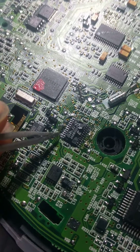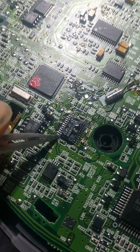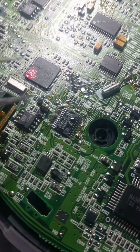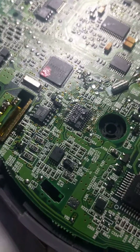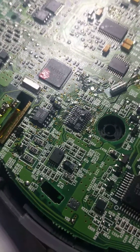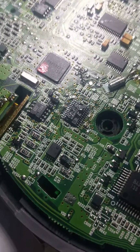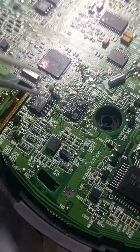A little bit of research unveiled that pins 23 and 22, I believe, so it's a 24-pin TSSOP chip. So 23 and 22, these two pins are the line outputs. And then pins 21 and 16 are headphone outputs. Interesting thing that I found out as soon as I desoldered this thing, because I did measure at 21 and 22, and I found a discrepancy. I found that one of them was outputting audio and the other pin was not, which meant either one of two things. Either this chip is bad, or it's feeding to an op amp stage that's bad and is shorting the output. I didn't really think the op amps were bad. I felt that was more unlikely, and that more likely than not, there was a voltage spike on the input and that this chip was bad.